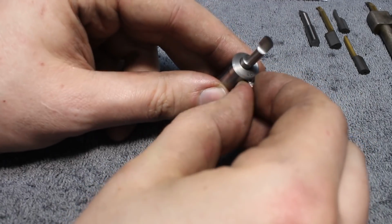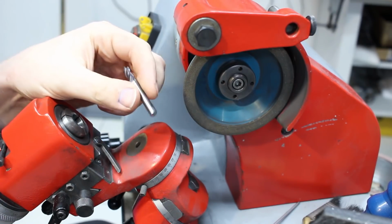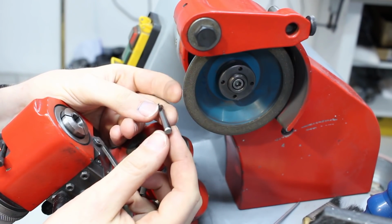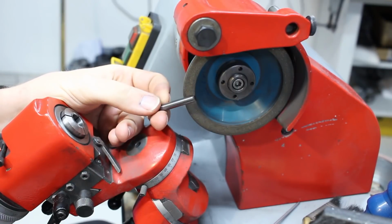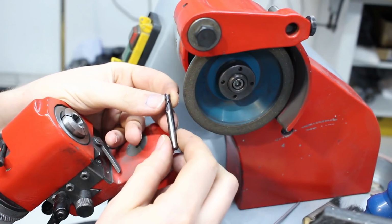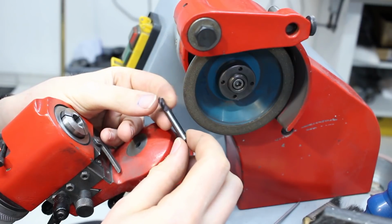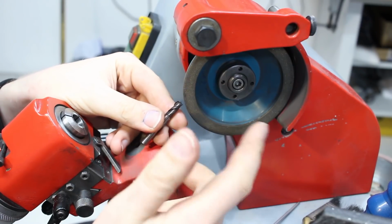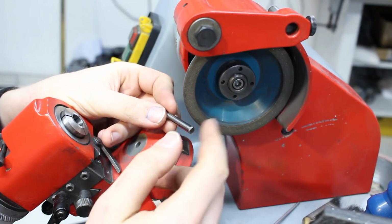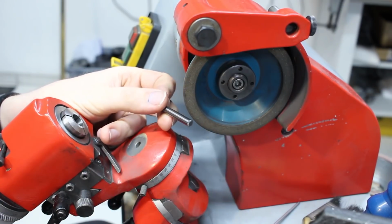That's all you need. Okay, we're finally over at the D-bit grinder after a lot of talking, and I found a broken, chipped 6mm carbide end mill in my scrap carbide bin. One thing about the carbide used in end mills, usually it's a very decent grade of carbide. Micrograin carbide, relatively tough, has to withstand an interrupted cut, which is milling. And it can be sharpened to an extremely fine edge, and it holds the edge very well.